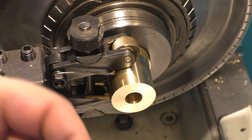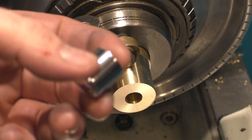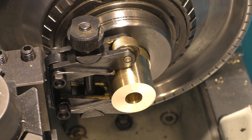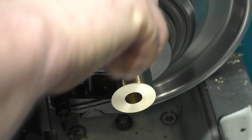The old cap was really cheesily done but slides on very easily - they just pressed out a little bit of material on the inside that catches a thread towards the end, so it just grabs and you spin it a couple times. We're not going that route, but we're going to make it quick so you don't have to spend a lot of time threading it on. We're about ready to start knurling - got to make sure we have adequate lube.